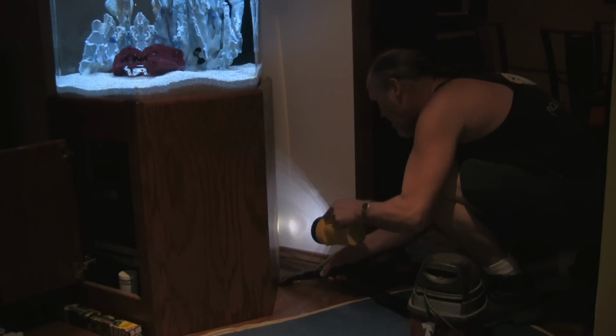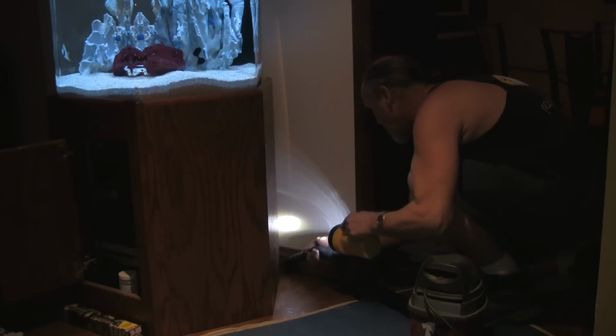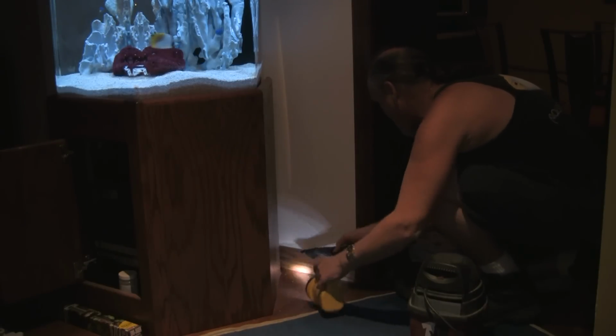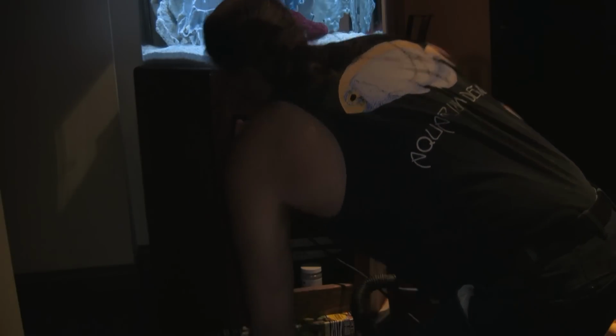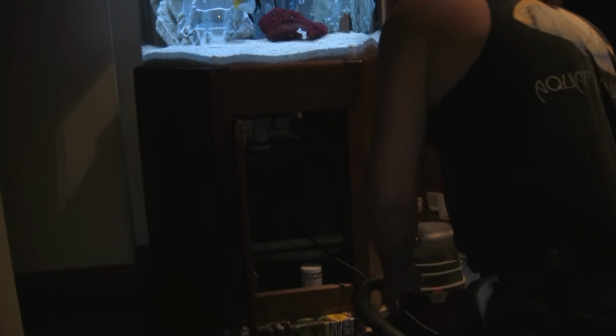Hardwood or planked floors are very attractive, but tend to not hold up to water spills. I've often suggested to customers who are considering these types of floors to have a second or third coat of sealant applied, as it's the sides of the planks that are the most vulnerable and will warp or turn up at their edges once soaked with water.